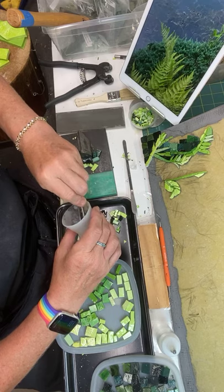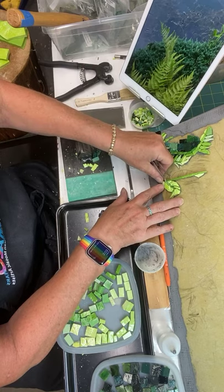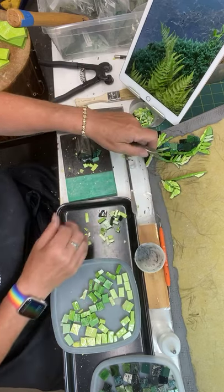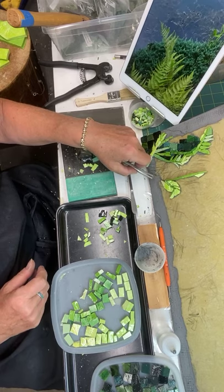You can tell when the thin set starts to get too old, because when you put the piece in, first of all, it doesn't stick. And second, ooh, I don't like that piece. Let's see if you can see.